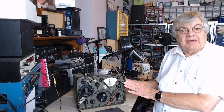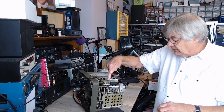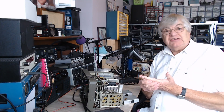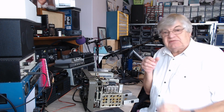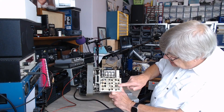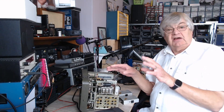Do you remember last time I was waiting for an RF amplifier valve to turn up? I got it all working. I decided the RF section — three valves: RF amp, mixer, oscillator as separate valves, whereas normally mixer and oscillator are in one envelope. Anyway, the new RF amp turned up, everything came up on medium wave. I'm listening to my benchmark stations, which are Radio Guernsey and Radio Jersey — they're only meant for the islands, local things. I use them as a benchmark on the CR100; any radio, if I can hear those reasonably well it's working all right. That was fine, I could hear those. I did some alignment — the oscillator alignment, the mixer, and the aerial on the RF side. Everything came up nicely, the dial on the oscillator was spot-on, and for two days it was working fine.